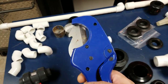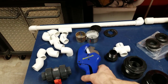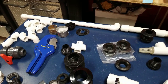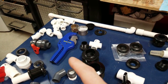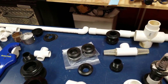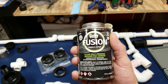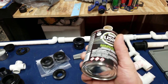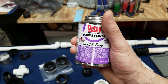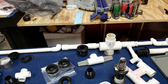Pipe cutters — if you're watching this you probably already know what these are. These come in handy, or a hacksaw works too if you're just doing a one-off job and don't want to spend the money on pipe cutters. A hacksaw blade is the cheapest way to cut cleanly. Also, here are different types of cement — this is a self-priming PVC cement so you don't have to use the purple primer. That purple can be pretty messy, especially if you're plumbing vertically, because it drips down.